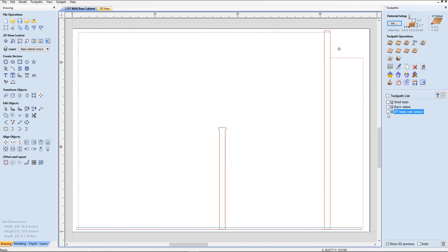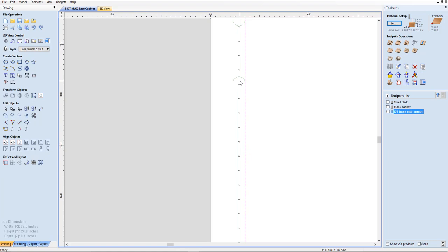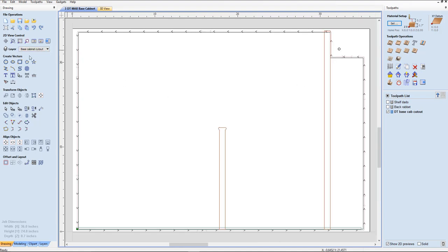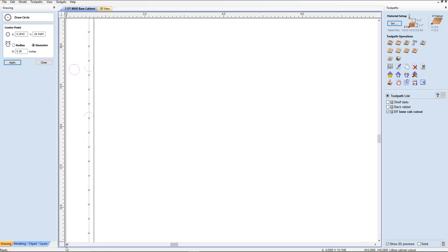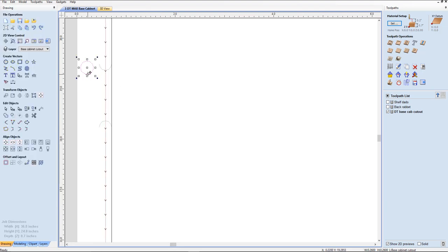Now when I click on this, it's outside the line — perfect. That's showing right there, there's your router bit. F to fit. Now I'm going to create a screw spot — 0.26 — because we want the router bit to be able to fit inside there. I'm going to go close to where that is right here and place that. I'm going to zoom in and see how close I can come there. That's pretty close if we hit the screw spot there.